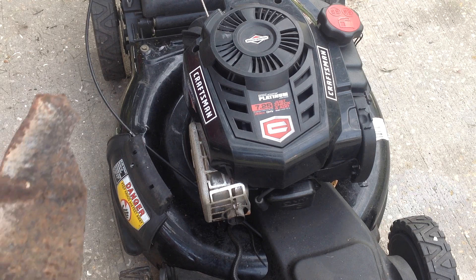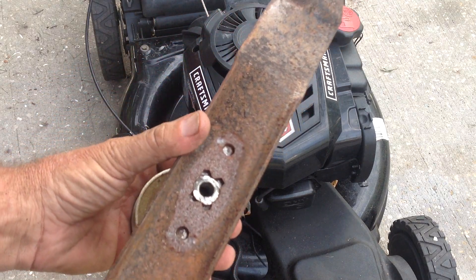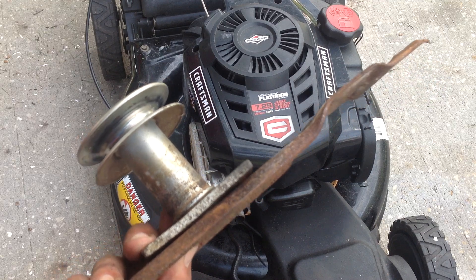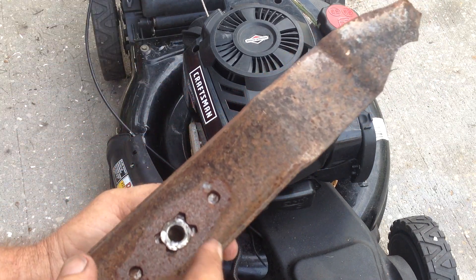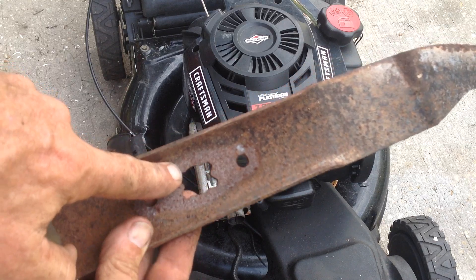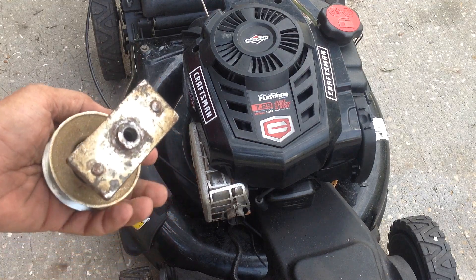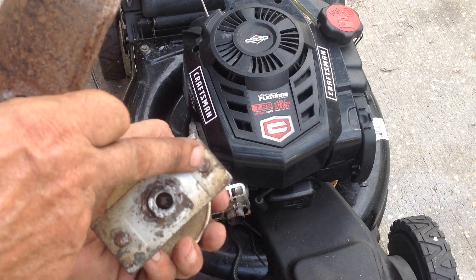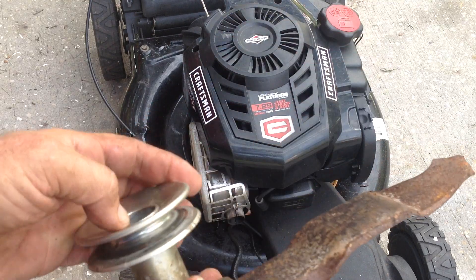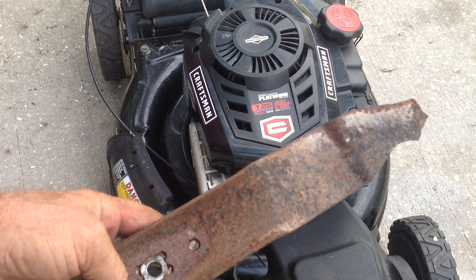Upon checking the blade when I had it on its side, I noticed the blade was a little off-center — it wasn't flush with the adapter. Whoever had it before must have hit something. They rounded off the bow tie here that should have the same bow tie stamping as the blade does, so that's completely rounded out and the two little stubby shear pins — the hold-down pins — are sheared off. I put a new adapter on it; I had a brand new one from the big jungle company, so I threw that on.